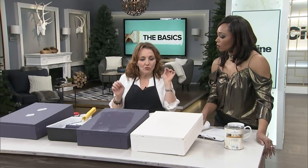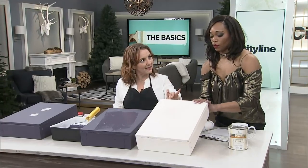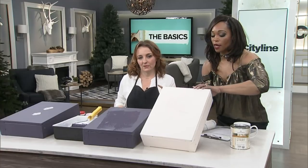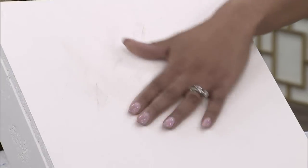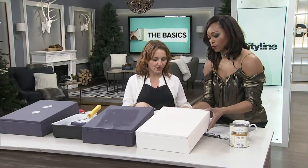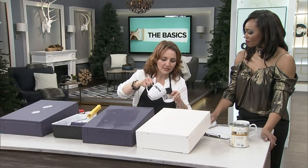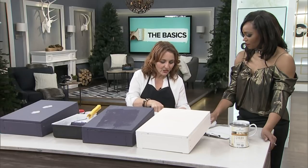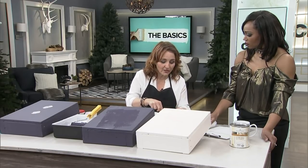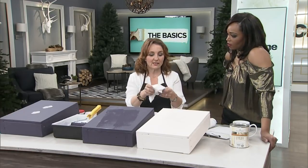You want to feather it out. One final thing — it's not so much painting, but if you get really good paint like Benjamin Moore, you can wash your walls. Say your kids had spaghetti and put their hand against the wall. There are lots of products out there, but I've been finding lately that trying to use more natural products, things I have around the house, works well. I found that baking soda with a tiny bit of water mixed up — baking soda is so fine it's not going to be abrasive. When you've got a mark that doesn't come off with just water, sometimes you can just use water and it comes off fine, but if it doesn't, baking soda helps.